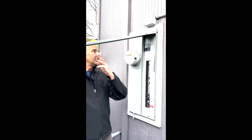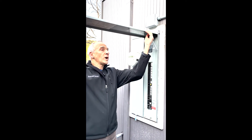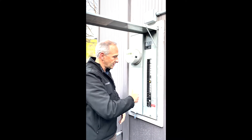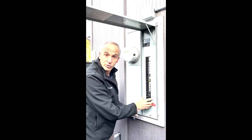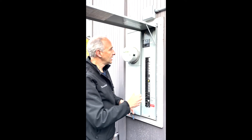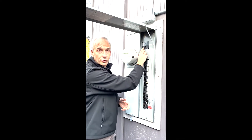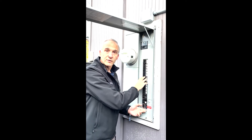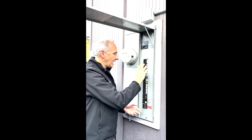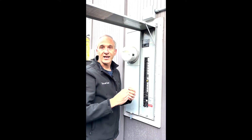On the other side is where contractors, electricians, and homeowners can access the main panel for your circuit breakers. These are all your circuit breakers. Sometimes you see empty little slots here — those are open slots where you can put in extra circuits. At the top you have your main breaker; here we have a 200 amp main breaker. When that flips off, all of your breakers are off as well. Each breaker serves a specific load — flip one breaker off and it cuts just that load only.